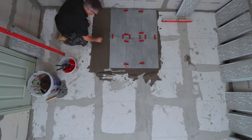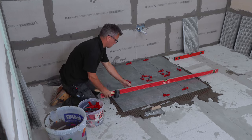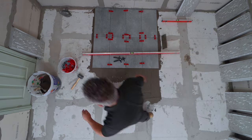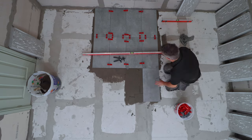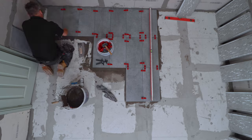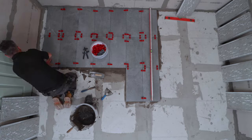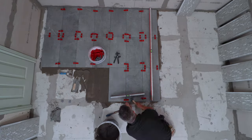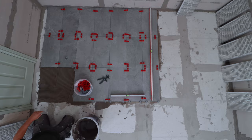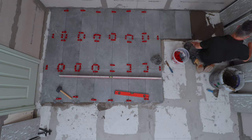The adhesive I'm using is a rapid set adhesive and you've got about 15 minutes to use this once it's mixed. Tile Mountain does stock a variety of different types of floor tile adhesive which won't react as quickly. So if you're new to tiling it may be worth considering using a standard floor tile adhesive rather than the rapid set. Now as you can notice I'm not doing a full line across the back wall — I'm starting to do my third course into the centre of the room just to keep it square, then I start to work my way over into the corner. This is just a little tip to keep your tiles square and neat so your lines don't veer off. Don't forget to keep using your leveling systems around each tile and double check your overall level with your spirit level.